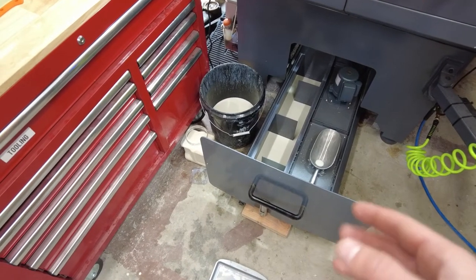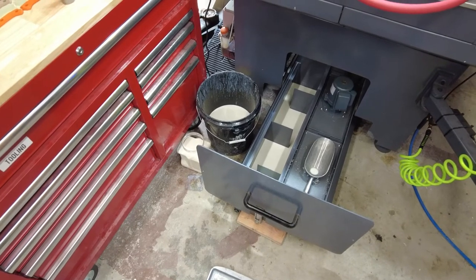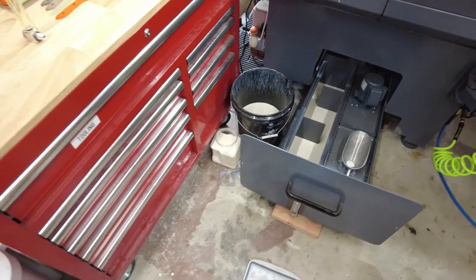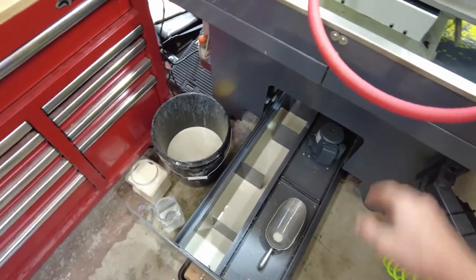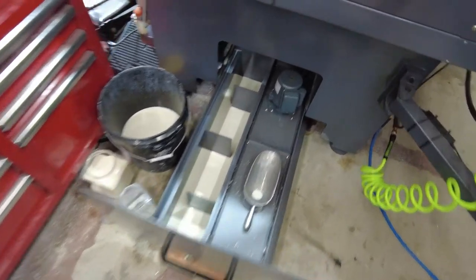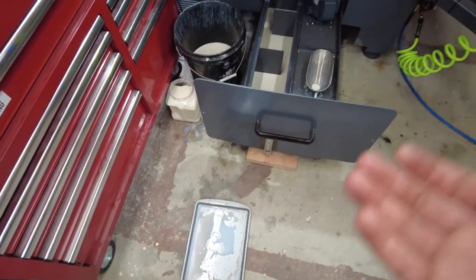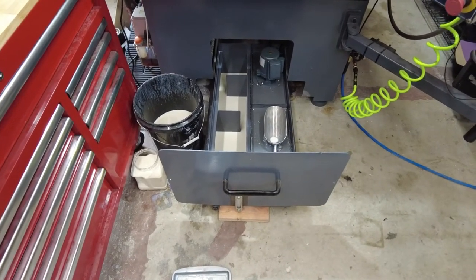I've got pretty much all the coolant out — there's still some in there. Because the main reason I'm doing this is simply to replace the sight glass, I'm actually going to save this bottom little bit of coolant. I found that by putting a little block under the front of this pan to tilt it, I've now totally surfaced my work area. That's another way to save some coolant — if you were to tip this thing substantially, you could probably keep like a few gallons in there and still be able to access the sight glass.